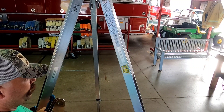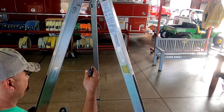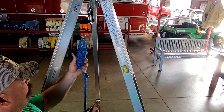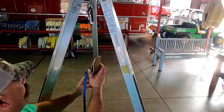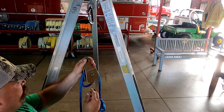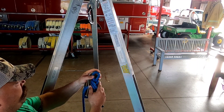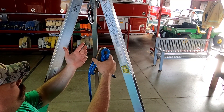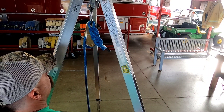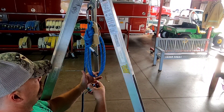We're back and we're going to start with a 4-to-1 and change it to a 3-to-1 — the reverse of what we just did. I'll start with my carabiner, gaff the anchor point the same way: gate facing me, nose down. I have my rope and COD pulley — I'll rig this left to right, throw the knot over the top and to the right. This time, instead of leaving the knot down, I'm going to bring the knot right back up to the top. Finding the flat part of the knot, I'll hang this now as one piece. The knot goes to my anchor — that creates an even system — and it creates two bites in my rope to hang another pulley off of.